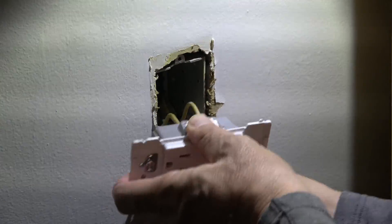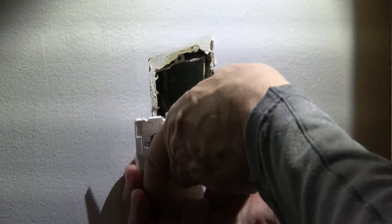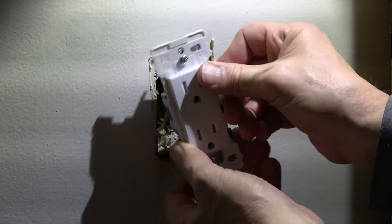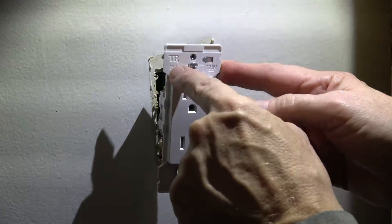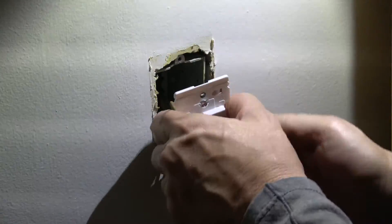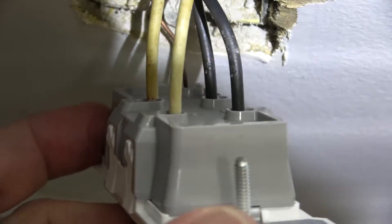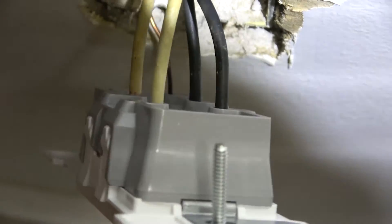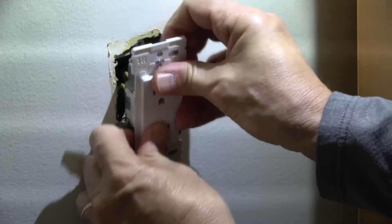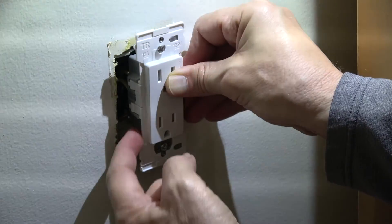I've got to get the ground, which is up at the top of this. So I push my ground wire in and pull that forward. If we look at the cover, it actually says 125 TR, so we know that's the top and the ground is down, which is common but not mandated by code. Now we make sure all our wires are nice and tight. And if we look back here, you can see there is no bare wire showing — except, of course, for the ground wire. So everything is protected, and now we're ready just to put this back into our opening. We push the wires back into the box.